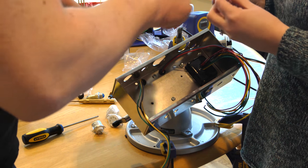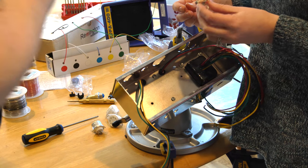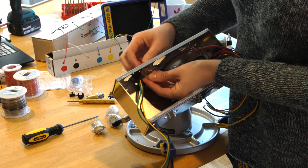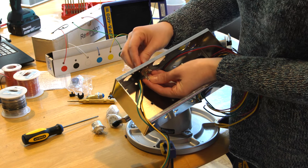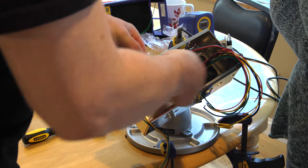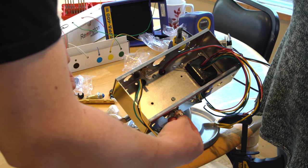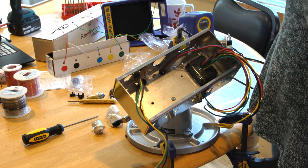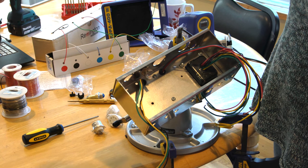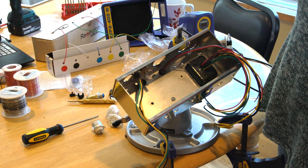The washer goes on the outside and the nut on the inside. For the speaker jack, the best way is with the tabs facing upward so you can see and access them when soldering. Just point all three mostly upward, and get it finger tight for now. A trick I like to do is mount them this way first, solder them up on the outside, then pull them out, turn them around, and put them back in — so you don't have to solder inside the chassis. We'll turn on the soldering iron, take a break, solder those, and come back.